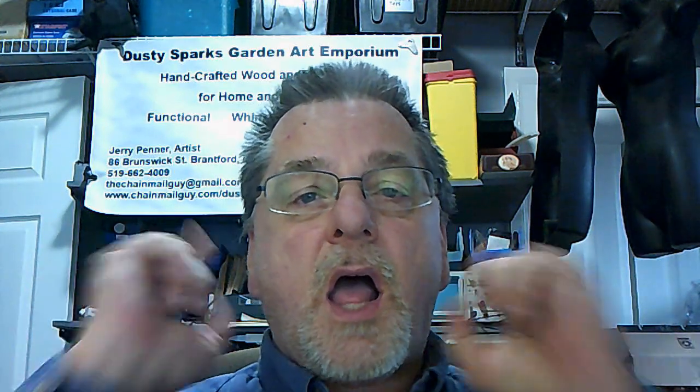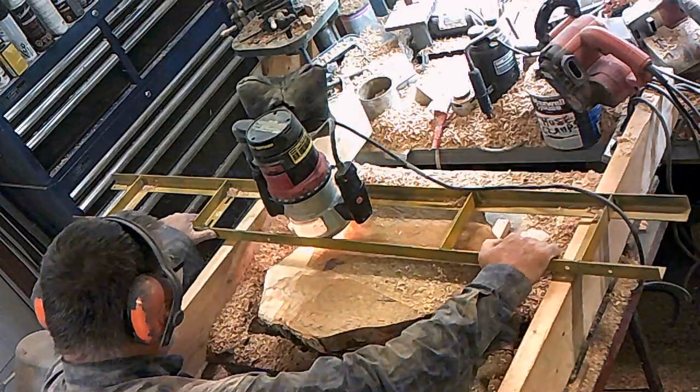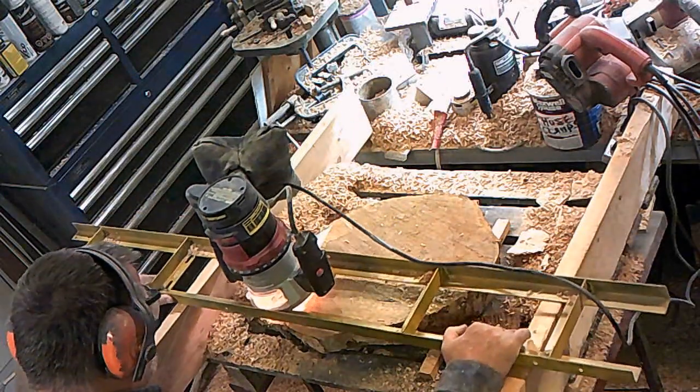How can you tell if the cut is too aggressive? Listen. As you're making the cut, the bit will sing in one part harmony. Pitch goes down as the cut gets more aggressive. If the cut gets too aggressive, it starts to sing in two-part harmony and sound angry.